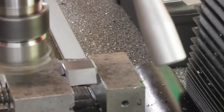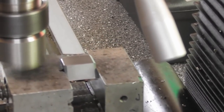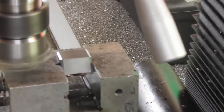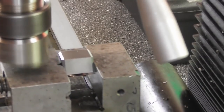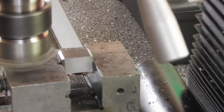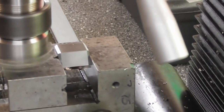So I've just machined the top angle off. I want to put a chamfer on the side in this plane. The edge of the cutter is at a 45-degree approach angle, and when I say 45 it's about 40 degrees, but while I'm set up in this plane, I can just wind the table back towards myself, or the saddle back towards myself, and just put a little chamfer on the edge of there until it blends into the depth of the other two chamfers. Just a tiny bit more, I think. There we go. That's the chamfers on that one.